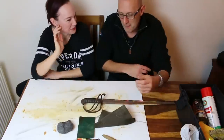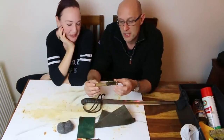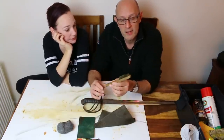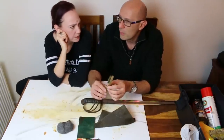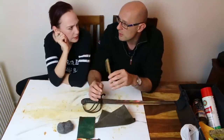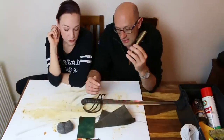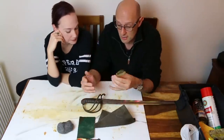Oh, and one final thing. This is a brush, okay? This is a brass brush. Now, these are usually used for cleaning suede. Suede shoes and boots, okay? Really? Yeah, you can buy these in any place that they have things like leather, like boot polish or shoelaces and stuff like that. Well, it's fairly soft. So the good thing about a brass brush is the bristles are metal, of course, so they remove stuff from the suede, but they don't really damage the suede that much. They sort of just scour slightly the surface. Interesting. Now that, I have found, is really quite useful at removing relatively light rust from rusty surfaces.